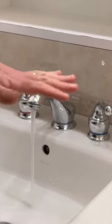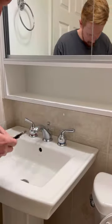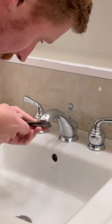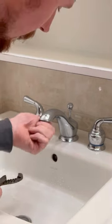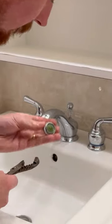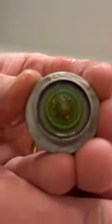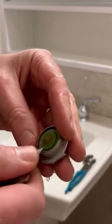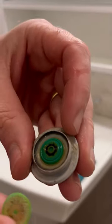If you're experiencing low water flow on your faucet, I'll show you an easy way to fix it. First thing, grab a pair of pliers and lightly turn the aerator right here to unscrew it. There's most likely going to be a bunch of junk in here — see the sediment inside? I'm going to get my knife and pop this screen off. See all that junk?